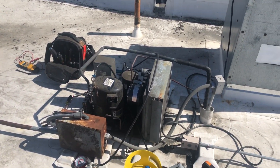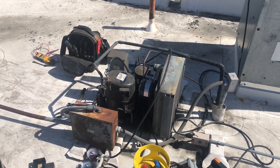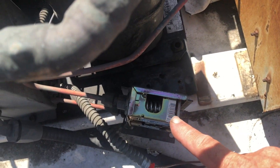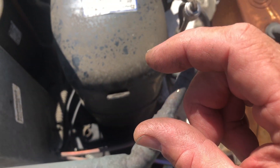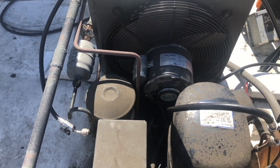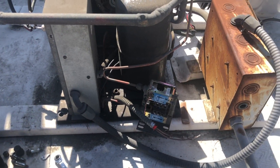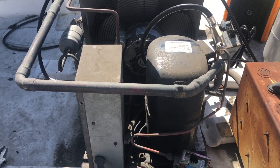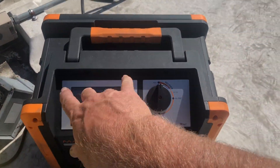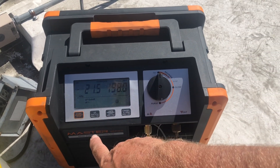No, it's not for your guitar — I'm just kidding around. This little bugger here is a low-capacity dual pressure control. So I'm going to change her out. We're going to replace this. I got some capsulated units — that's going to go with the sight glass. I'm going to sweat in a dryer sight glass combo and a new compressor. It has a few more settings, like the fill piece does. I just don't have time to get into this with you guys today — trying to get my job done.